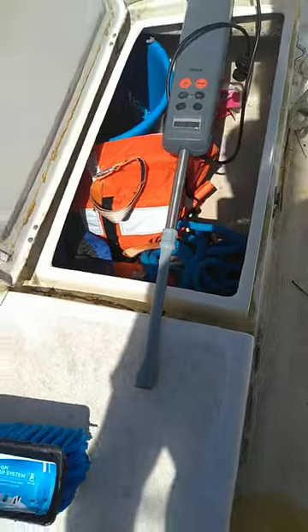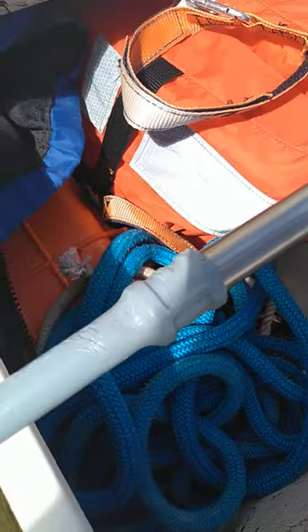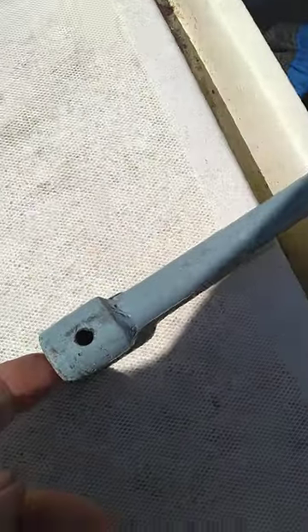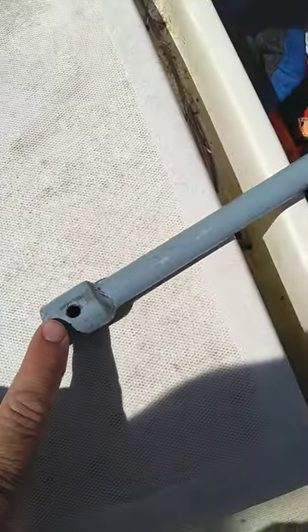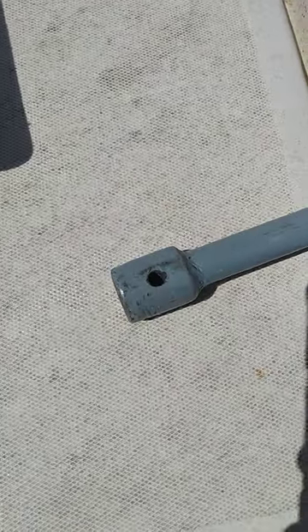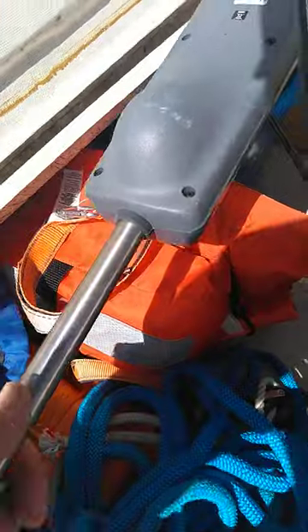You've got to add eight inches to them. I made the extension out of a piece of galvanized pipe — welded it right there, it threaded right straight on that end, it's a regular old pipe thread. And in this end I just filled it full of epoxy and sawdust mixed together, crammed it full, then drilled the hole to fit the pin on the tiller. That's all there is to it.